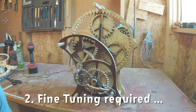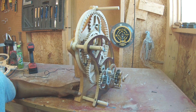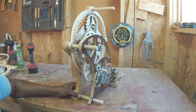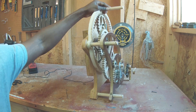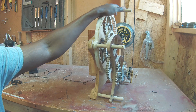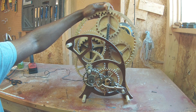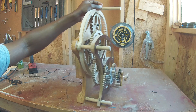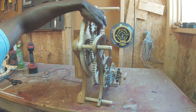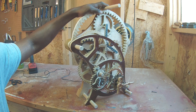Issue number two is how easy it is to take apart. I was actually thinking a great deal about that when I first designed it, but you will have to fine tune it, and because of that you should design this in such a way that it's easy to take apart. Looking at this gear right here, the shaft that holds these two gears in place is just pressed in. Initially the hole was really tight, but after taking it off five or six times it became really easy for that shaft to slip out. So what I would do in the future is make all the shafts lock from both sides instead of being press-fit — push it all the way through, have a lock collar on the front, and every time you tighten it back up it would tighten snugly.